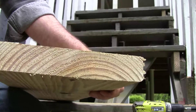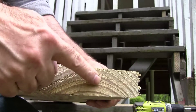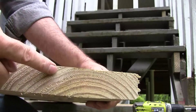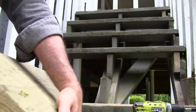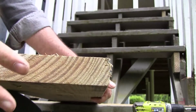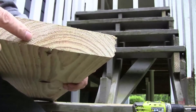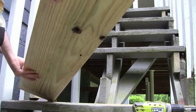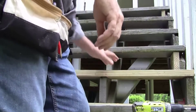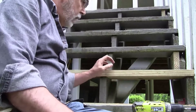Let's talk about the position of laying wood down, especially for walking surfaces. You always want the crown up. The board is crowning — curving — like so. If you were to do it the opposite way, eventually the ends will curve up and buckle. So you always put the crown down toward the walking surface — or rather, crown facing up so the center bows upward. I've already pre-measured this, so it's pretty much just getting this screwed in, secured, and ready to go.